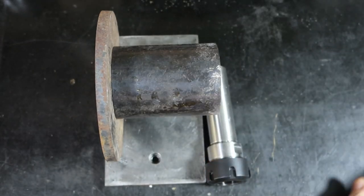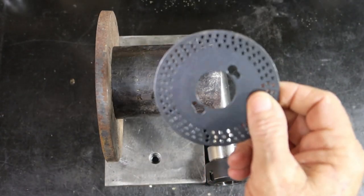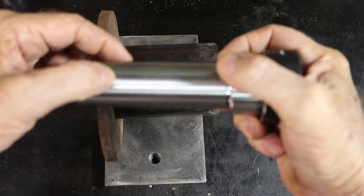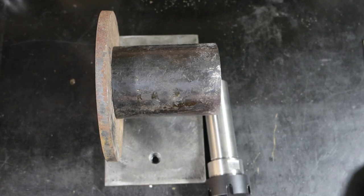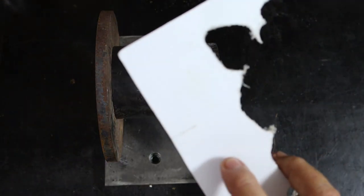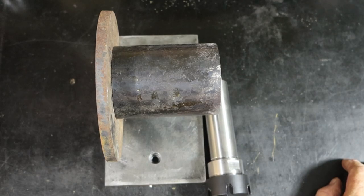Unfortunately that opening image is a welded-up steam pipe flange and the damn thing got so hard that I'm flat-out machining it, so I'm going to have to forget about that. I really wanted to put thrust bearings behind each end but I couldn't get a thrust bearing with a 32mm ID. My mate up in Bangkok gave me a sheet of Teflon — I believe Teflon is the slipperiest substance known to mankind, and the more pressure you put on it the slipperier it gets. I'm going to try and make a couple of thrust washers out of it.